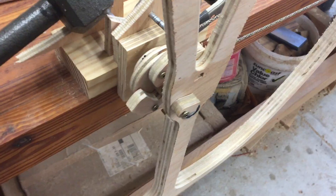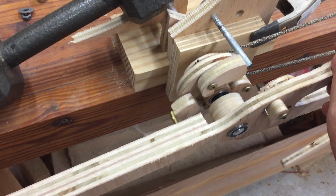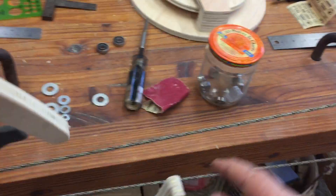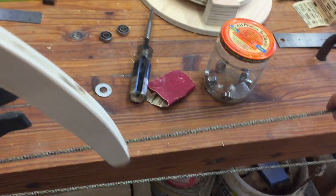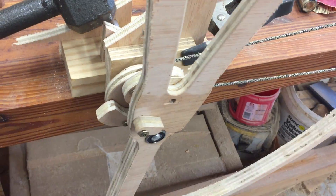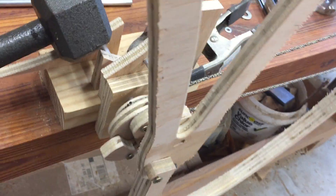Anyway, the way this normally works, it's going to be turning around like this. Let me start at the beginning — it's driven by a weight over here. The weight is pulling this line that way, trying to turn this pawl mechanism clockwise. It's being held in place by a steel pin coming out of a temporary back plate.